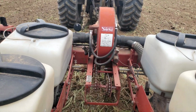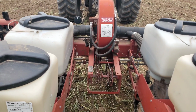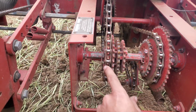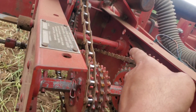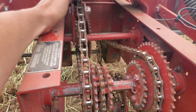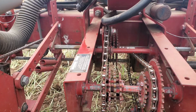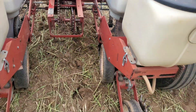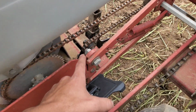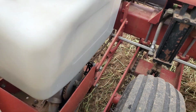My brother was having problems with the chains and how to use a white planter tutorial. Obviously, every time that you switch these sprockets over, you need to adjust them sprockets right there, which are the holder, so that this cannot physically go. See, that's got a little bit, but it can't go enough to where the chain can pop off. I didn't even have to read the book to figure that out. He was having problems with this one here popping off of the idlers, the tensioner, and I just went and got another spring and tightened that up, and it seems to be working good too.